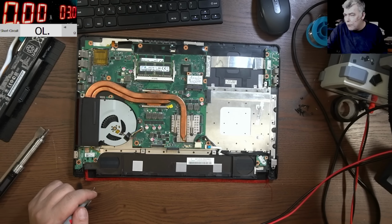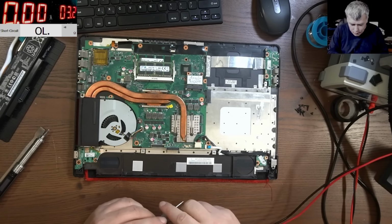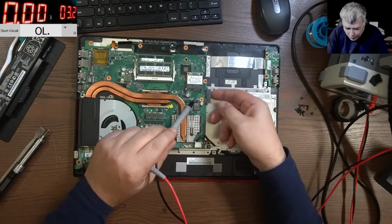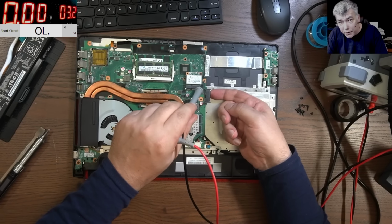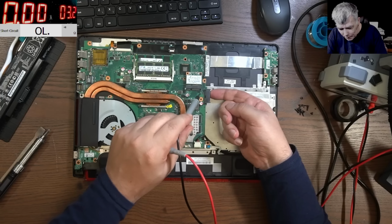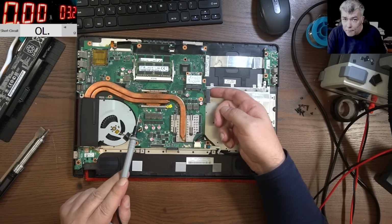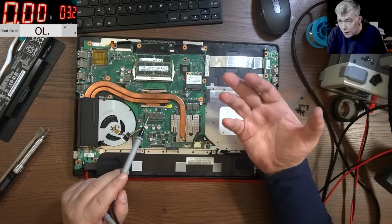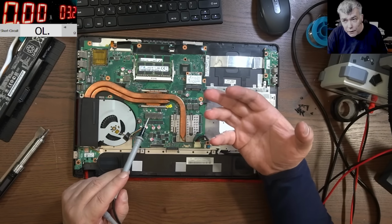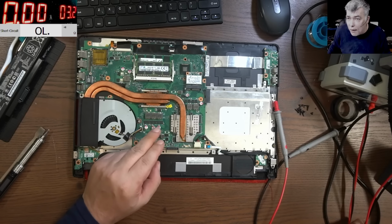Let's lower the voltage. There we have like 1.8. Yeah, let's use a low current. So grab your power supply, because there is no other way to fix this fault without the power supply. Yeah, so don't get fooled. I mean, I understand people are trying to avoid using the power supply because they're afraid to burn something.